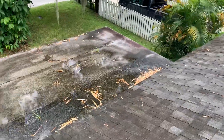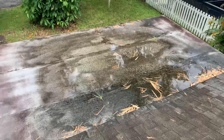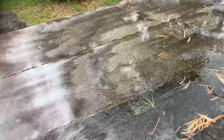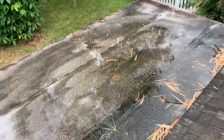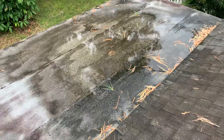Overall, I just want to keep an eye on this. You can see all this ponding water up in the front — it's breaking down the material. You can see some of the granules sitting there versus some of the other material. But the main thing is when water sits on these seams, it'll back up and create a leak.